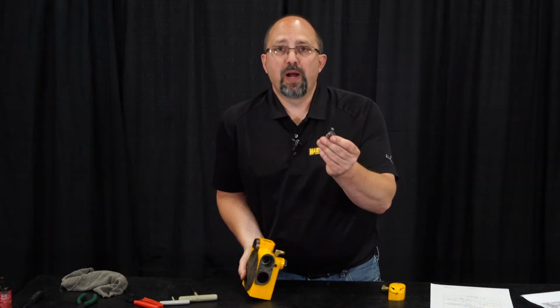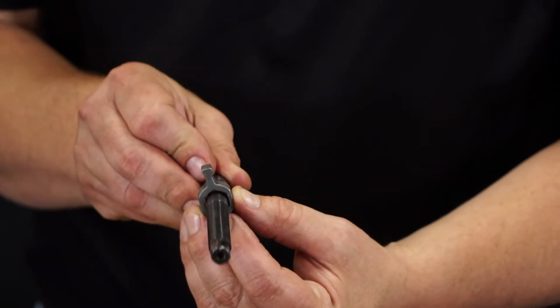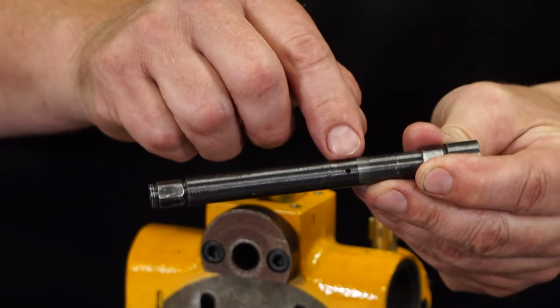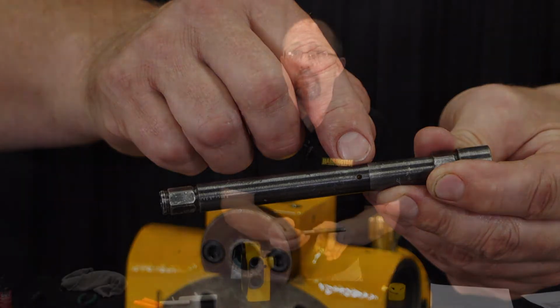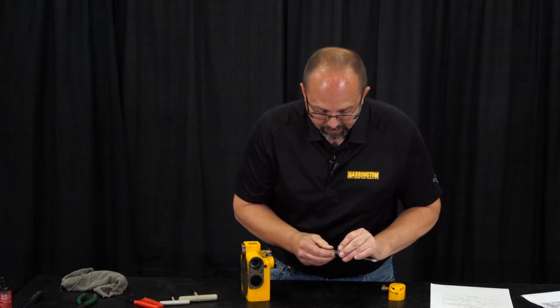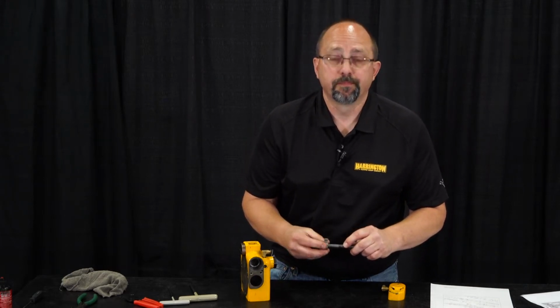There's our main spool actuator. You can see that has a hex on it where it is keyed to the limit shaft. And as the limit shaft comes through, when you put this all back together, you have to make sure that the hole for that hairpin is horizontal. If you're one flat off, then your hairpin's going to hit the air motor. So that has to go together so that the hairpin is horizontal.